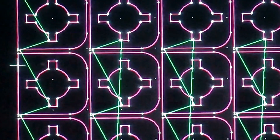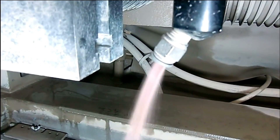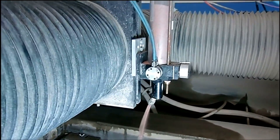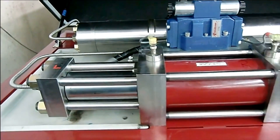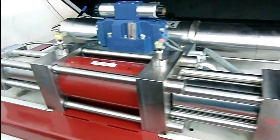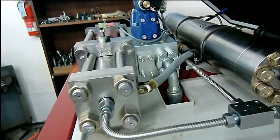At this point, we are cutting the second part of the outer contour, and then the traverse. In order for water to cut through metal up to several inches thick, the water is mixed with an abrasive. The water-abrasive mixture proceeds down through a tube to the cutting head. The high pressure is created by a sophisticated pumping system that generates about 50,000-60,000 psi. The tube on the right stores the high pressure water that goes to the cutting head.